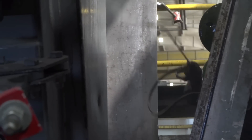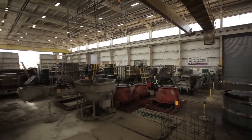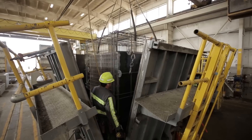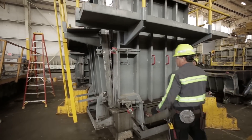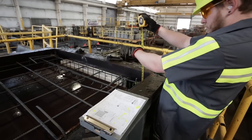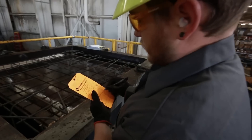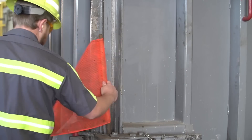Then a form release is applied to each surface to ensure the final product can be easily lifted from the form. Now that the form is prepared, the overhead crane is used to pick and place the cage onto the core of the form. Care is taken to ensure that the reinforcing cage is stable for transport to the form. Once setup is complete, a certified quality control technician will conduct a pre-pour inspection to ensure conformance with the approved shop drawing. Upon satisfactory completion of this inspection, the technician will sign off and flag the form indicating approval to place concrete.